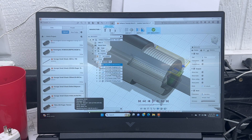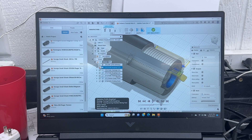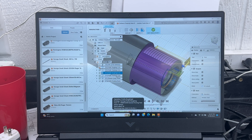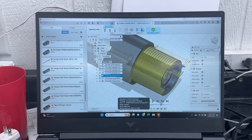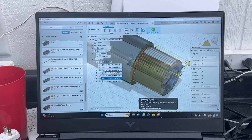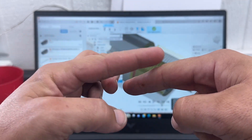I've got all my machine steps written up. I'm just going to do this by hand. The first thing we're going to do is drill, and the next step is going to come through and we're going to take a roughing cut with the chamber - you can see it just goes back to front to pull the chips out. After that's done, we do our outer tenon work - we go towards the barrel on the first one, then we come back and go away from the barrel. After that we cut our threads, and the final step is the reaming step.